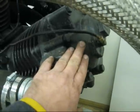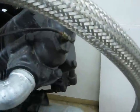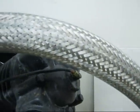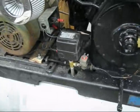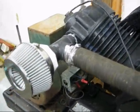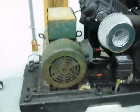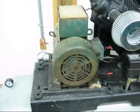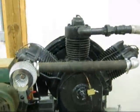And if the unloader pistons leak when the pilot air pressure hits them, some of that air pressure goes into the compressor and doesn't stay in there and activate. So we've got to fix that and get the electric pilot control hooked up. I was also missing the air filters, so I hooked that up. Hopefully I'll get some good service out of this. I still think I need a larger motor — I think that one's going to be overtaxed. But the pump itself shouldn't wear out anytime soon.